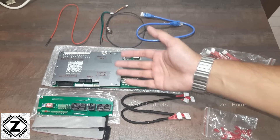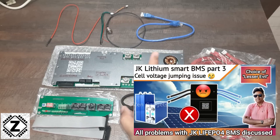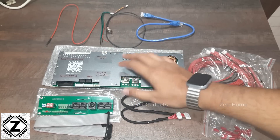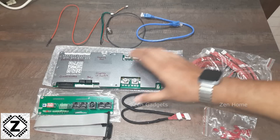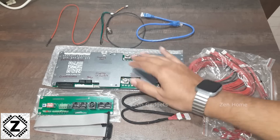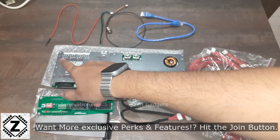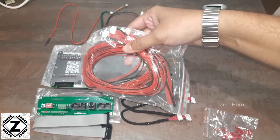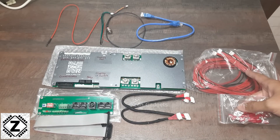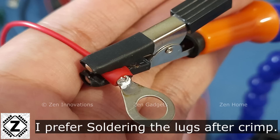Unfortunately, JK never seems to take feedback or reply to emails. If you want to know more about problems and inaccuracies with JK BMS, an English video is available covering those faults. I'll also test this particular BMS to check if they've improved accuracy alongside the hardware improvements — so stay tuned and hit subscribe. The balance leads and NTC thermistors are inbuilt into this cable loom; the other ends are open, and I've sourced lugs to connect them to the battery during the build.